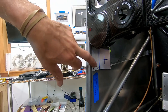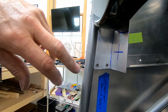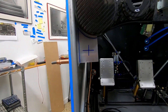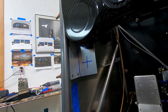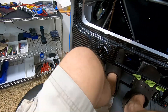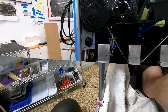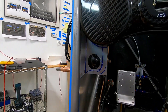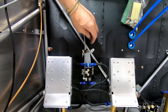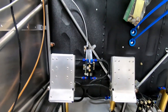That's kind of what it looks like when installed. I decided to put the face forward - that helps recess it. It goes back about three inches just to create a little bit of leverage. This is really solid so I'm not worried about it. Here are the other two screws that go into the metal. I think that's a good spot for the parking brake handle. I'll figure out what to trim off and how I want it to look. Quick check to make sure I don't regret that parking brake position later - obviously it'll be rounded, but with the seat all the way forward my shin does not hit it. I got carried away and installed it all including safety wire, bolted it in - at least I know it works. Now I have to take it all apart again.